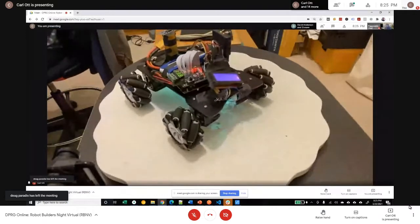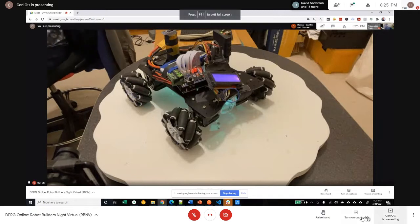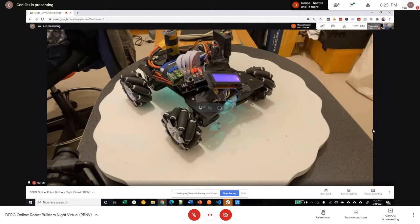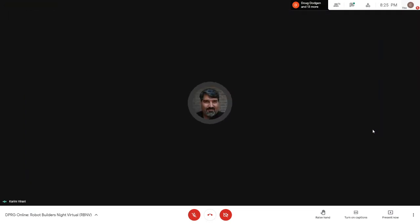Go ahead, David. That's all right. I was just going to say, I don't think it's probably that difficult. You'll find the bug pretty quickly. The zero crossing handling is not that tough. Like our PID loop controller has a continuous mode, and you tell it where it crosses zero, and you can scale it to whatever that is. And once you have that figured out, it'll probably be smooth sailing. I'm 99% sure there's nothing wrong with the IMU's output.